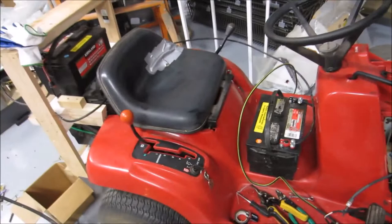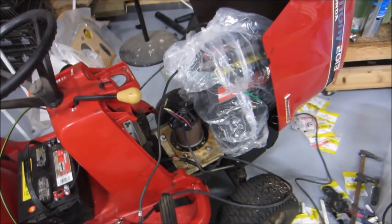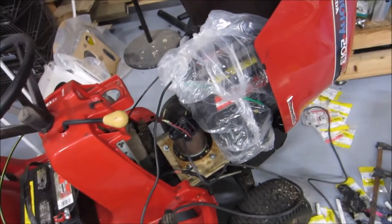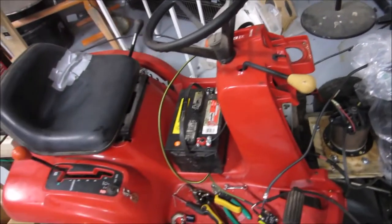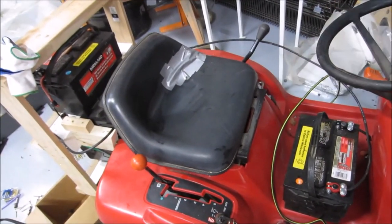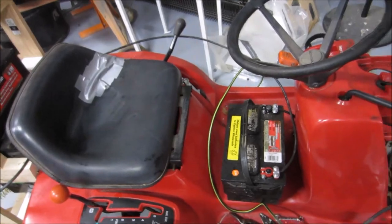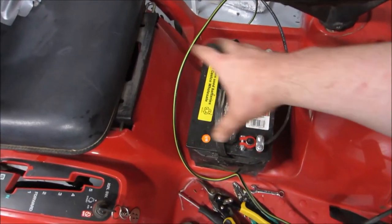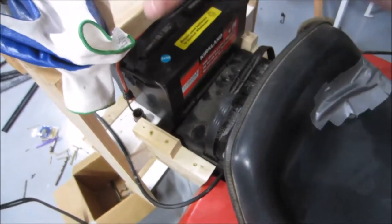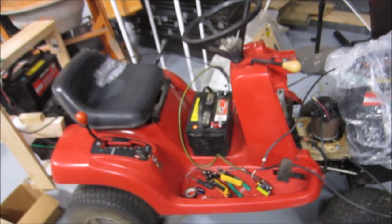And the last piece, which is actually kind of tricky, is the charger, because this is a series circuit, so this is 72 volts of DC electricity, and I would have to have some kind of charging circuit that would actually bump all of that up to 72 volts. Alternatively, what I could do is have a parallel set for everything in trickle charge, and then a complex connector that would just sort of fit in and talk to all of them simultaneously in parallel. I would actually like to have some kind of manifold over the center battery and over these back batteries here. I'm hoping because this is using 6 batteries, it will have a pretty good amount of amperage.